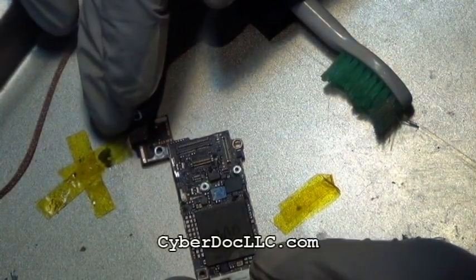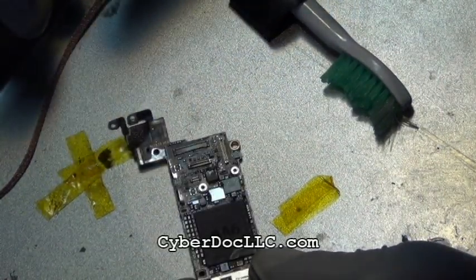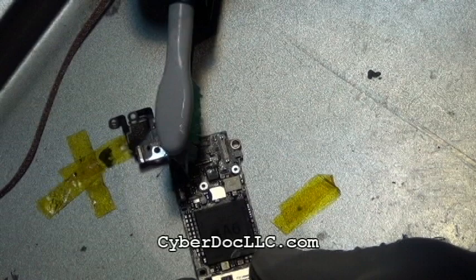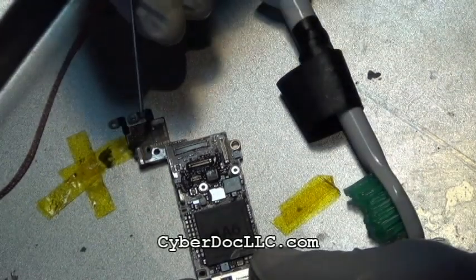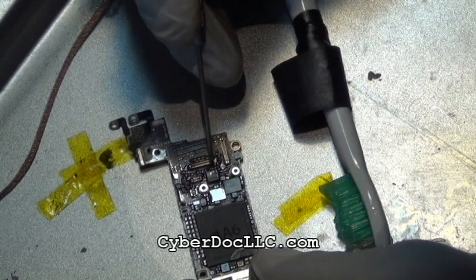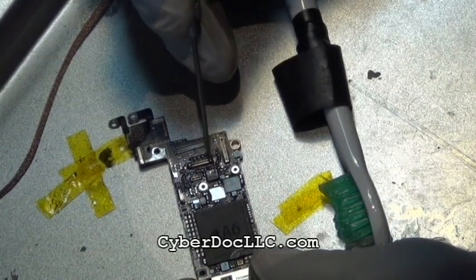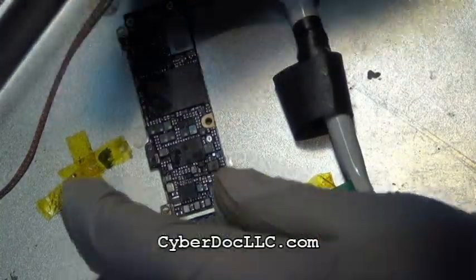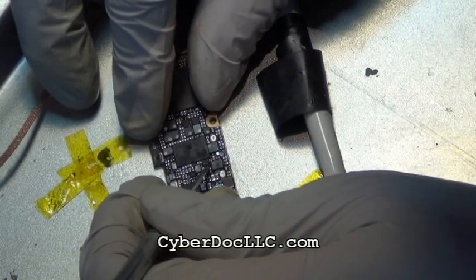Always resupply your flux if your flux runs dry on the board. The flux itself is going to activate the metal. In other words, it's going to deoxidate the metal by the active acid inside. And more importantly in this repair, since the flux I use doesn't really have a very strong acid in it by definition, because it's no-clean flux, no acid in there, it's just weak acid. More importantly, the flux is there to conduct heat, to supply equal distribution of the heat to the component you want to solder. So, yeah.